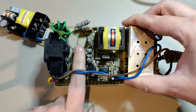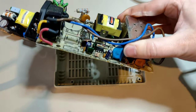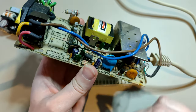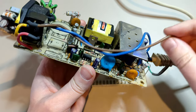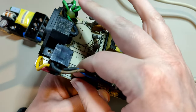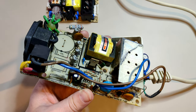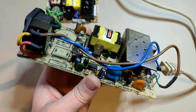New plan: as you can see, I've removed a bunch of components. My thinking is I'm going to saw this board in half. This piece of video is going to act as a reference for me to make sure I know where things go and where all the wires connect, because this also has a relay that I'm going to have to fit in somehow — so that when the Amiga comes on, the relay also powers the hard disk on. I think that should be easy to just wire in, in basically the same way as it is in here. I've already desoldered everything. Next, I'm going to cut the thing up, have it free-mounted inside, figure out all the wiring again — as with the multiple previous PSUs — and then sort out the grounding and everything else.